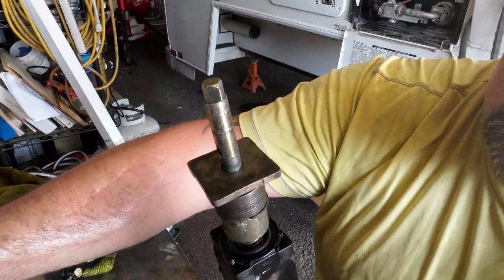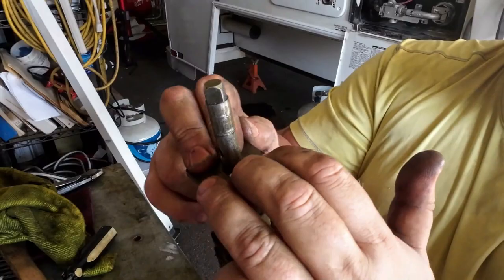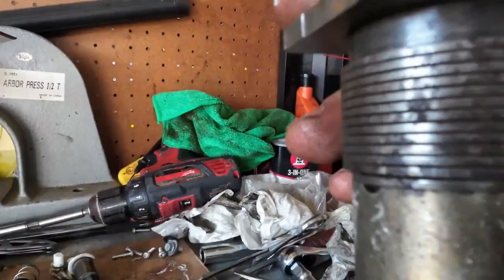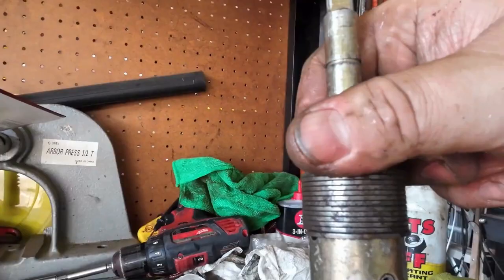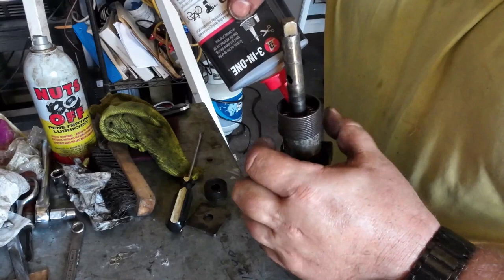What time is it — four o'clock? Lippert's closed so I can't call them. This is where all the weight rides on this guy. You can see it moves one direction and it's supposed to stop it. I have the electric motors which stop this basically from freewheeling. I think if you don't have the electric motors, this brake is what's going to stop it from freewheeling. Thank god — I need to oil this bearing, that would've been a no-no. Just put some three-in-one in there and put it back on. She's ready to go back together.